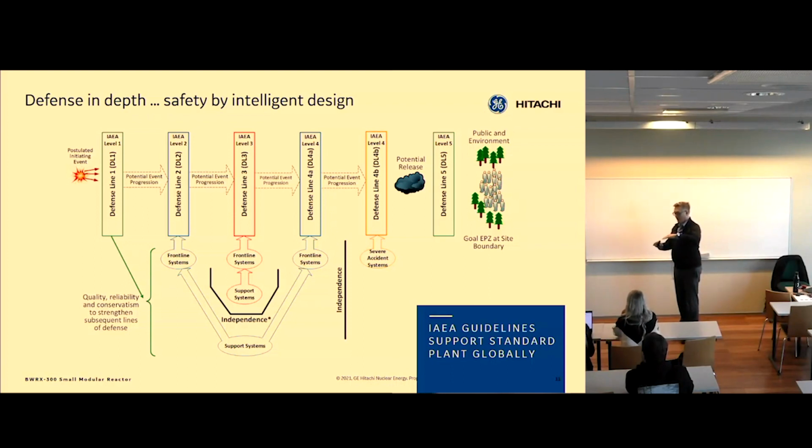So the level will start lowering. The standby pump sees that pump trip because it looks at the discharge pressure, and it starts. That start of a standby pump is our defense line 2 function. So start standby pump, and that will bring level back up to normal, and you can continue to run the plant and repair the other pump. So that's defense line 2.